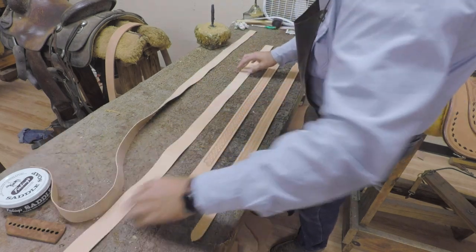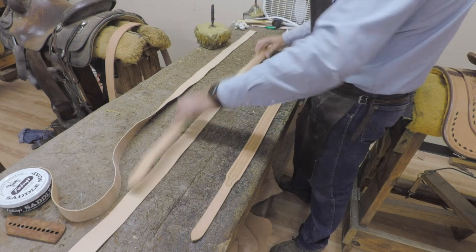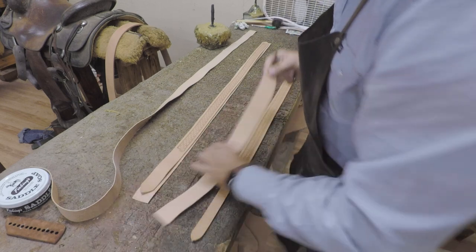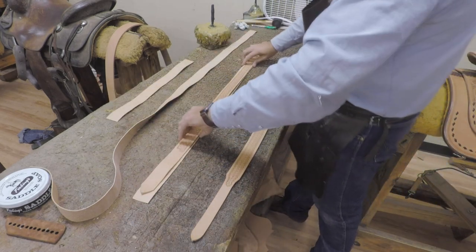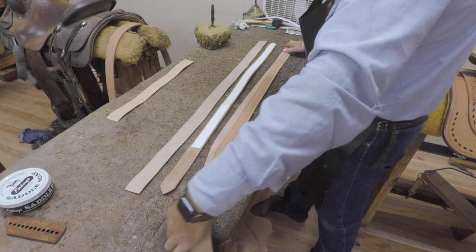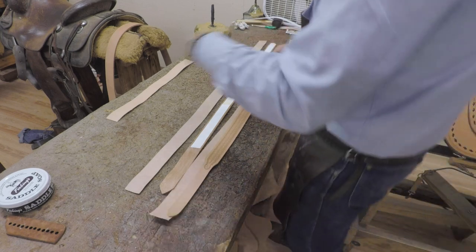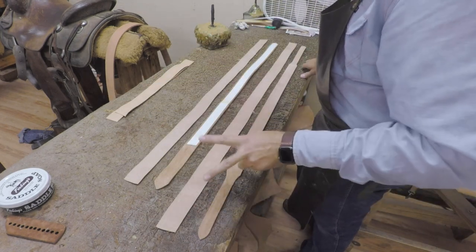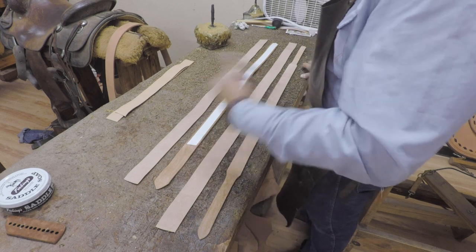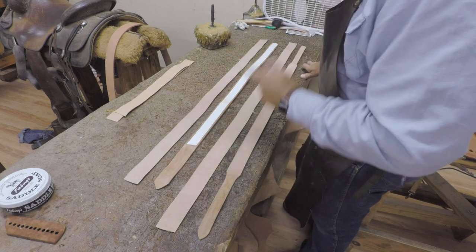Put the liner down, then set the belt on top of it. I like to leave just a little bit of overhang out the front so you're sure it's on the liner when you glue it down. Then I'll cut it just a little bit past the belt bend so I know it's the right length. We're ready to put glue — we're going to do two coats on each piece. The first coat usually just gets absorbed and preps the surface; the second coat is for stick. Let the first coat dry, put another one on, let it get tacky, and stick them.